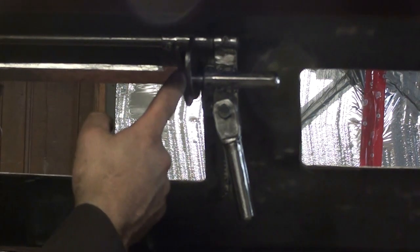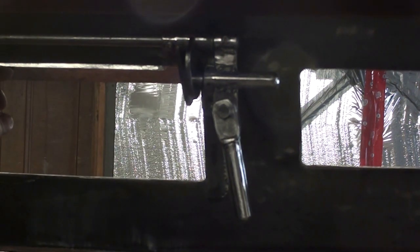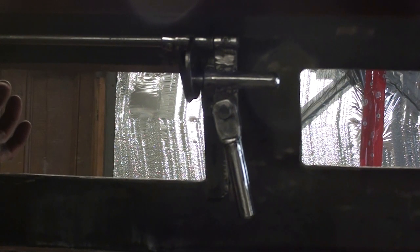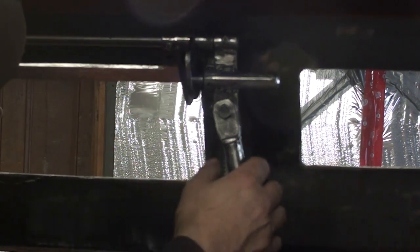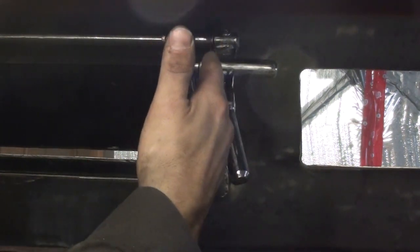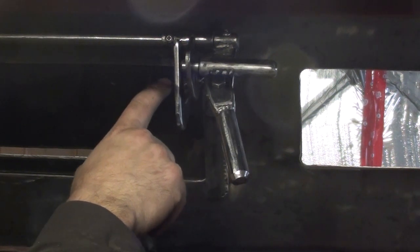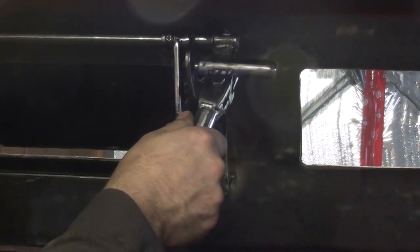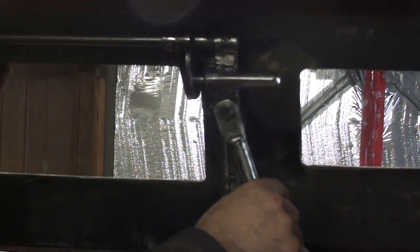This plate here that has the holes that it locks into place, it was really tricky to try to determine where those holes were going to be, and ultimately it could be a little bit more open. And the other thing is this half inch pin, for whatever reason I didn't get the geometry just right. Maybe the lever needs to be down a little bit more and this arc would be a little larger, but as it stands I can only get two positions, open and closed. The original had a locked, closed position, it had a partially open, and then it had a fully open.